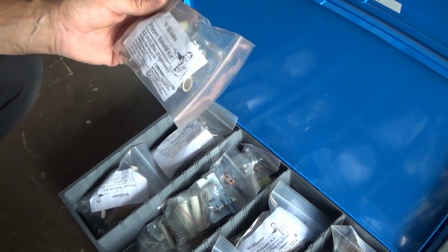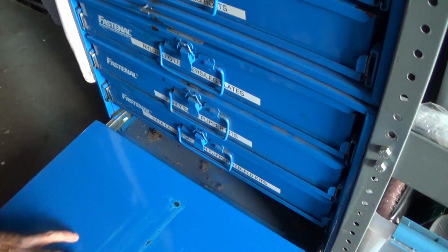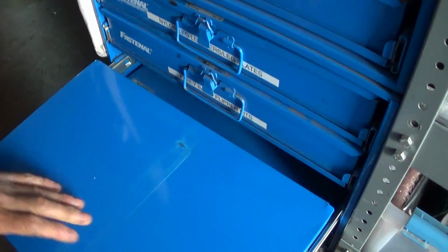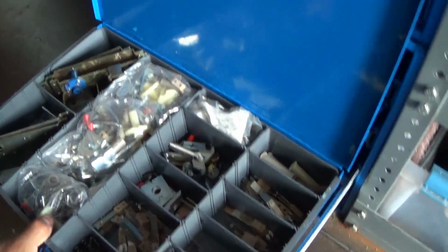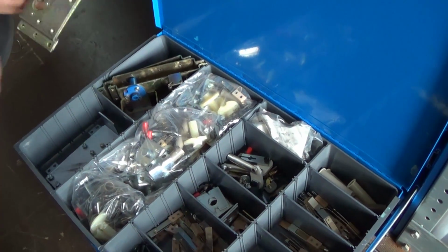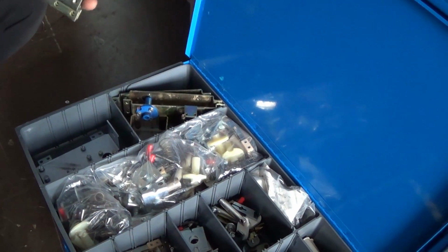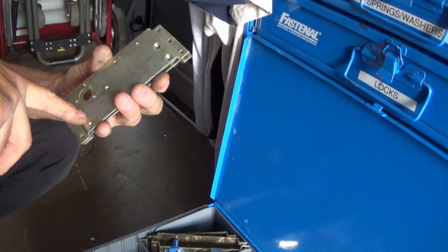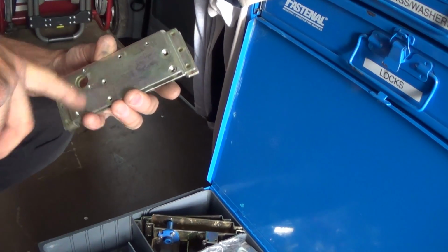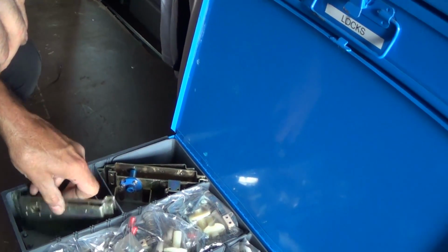Okay. What about the new Sterns? Are they doing kits for those as well? Yeah. New Sterns, our Data East, Sterns, Segas are in here. I have extra plates because sometimes screws break off in these. They tend to, for some reason, Sega and Stern used Loctite in these quite a bit. And when you go to take anything off, even a hub, you break off screws. And of course, you can fix that, but not very well in the field.